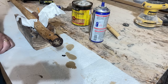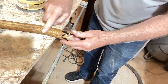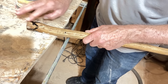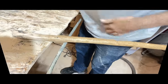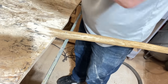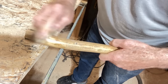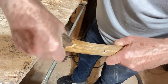I'll leave it 10–15 minutes until it's good and solid. Then I take the 150-grit sander, go around it again, rolling the stick and moving the sander to polish it up. That doesn't take much — as you can see that is real good. Now I'll put some more stain over that — see how dark it looks with just a little bit on the rag. That just looks awesome.